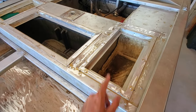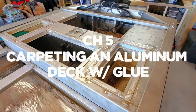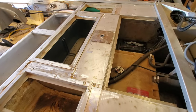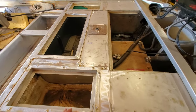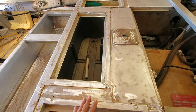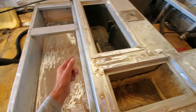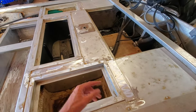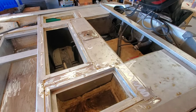I've shown how to carpet an aluminum hatch lid and a flat wooden floor system. Now I'm going to show how to carpet the factory aluminum rear casting deck in this Bass Tracker. A couple quick notes: this is a carpet video, not a prep video, so I skip a lot of prep work. This boat came to me 90% prepped — I did minimal work with chemical glue removal inside the track, some scraping, wire brushing, and a paddle wheel on an angle grinder. The first time I did one of these I was super intimidated, but the more I've done them, the more I've gotten dialed in as a solo operation.